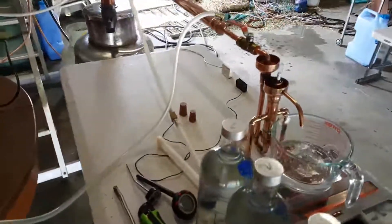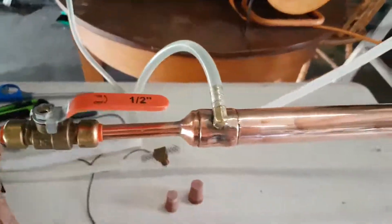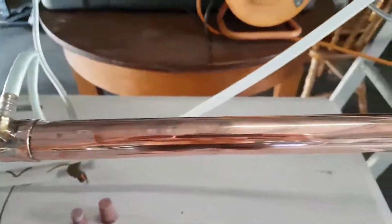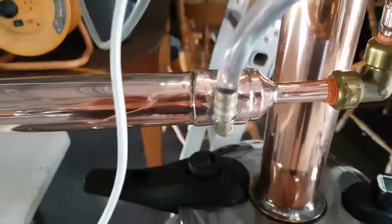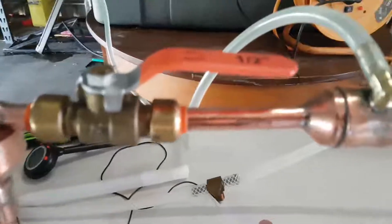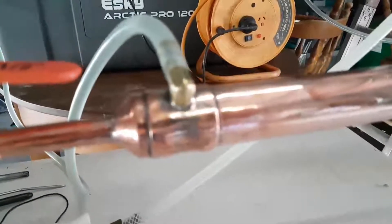Got this clear tube running here to the horizontal condenser. Made out of 12mm and 20mm segments on the inside, with 32mm tubing on the outside — or copper pipe. All the fittings have been silver soldered using oxyacetylene.